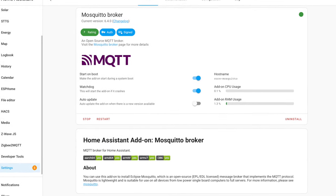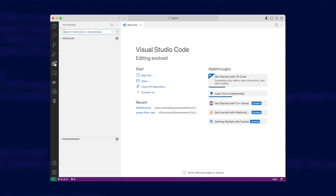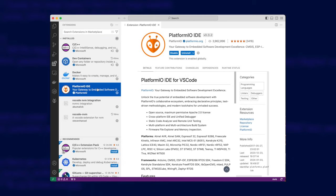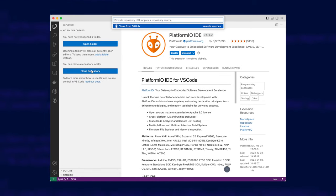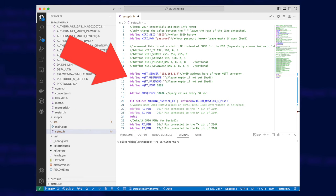Once you've built it, you need to program it. But before you can program it, you need somewhere for it to send the data — an MQTT broker. The easiest option is to install the Mosquitto add-on in Home Assistant and create a dedicated user account for use by Mosquitto. Make a note of that username, password, and the IP address of Mosquitto, which is probably the same as your Home Assistant one. I then downloaded VS Code, installed the PlatformIO IDE extension, and cloned the ESP-Altherma GitHub repo. You'll need to edit a few files, starting with setup.h to add your WiFi and MQTT server details.